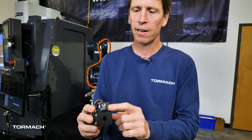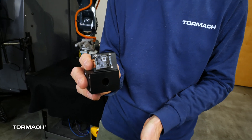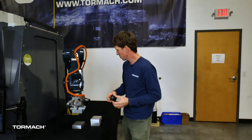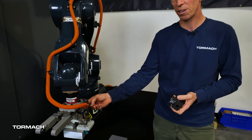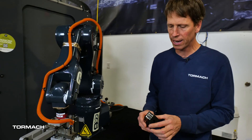Now let's talk a little bit about how the algorithm works. In this particular LIDAR sensor, we have a laser source which generates a line of laser light — think like a laser level. And then we have two detectors here, two sensors that look like little eyeballs. Those two sensors are separated a little bit, which gives us a nice field of view and also helps minimize distortion. That line gets reflected off of the table surface or the objects and bounces back into these two sensors.